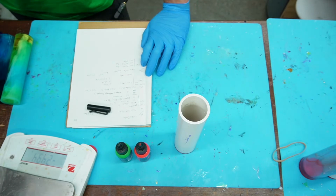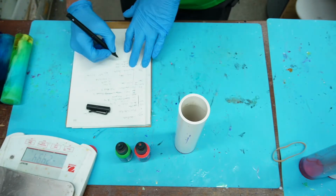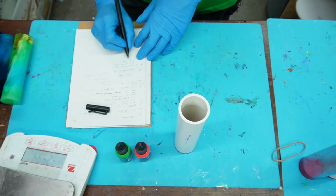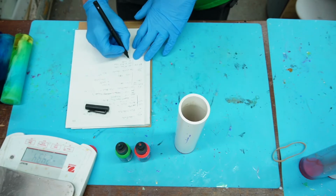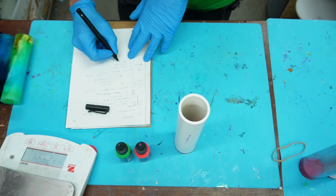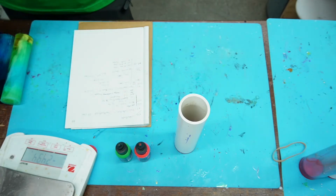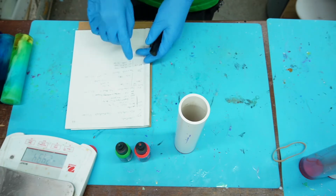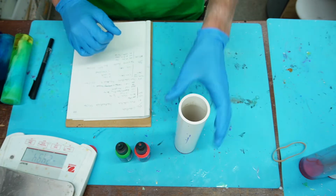All right, so we're looking at like a 1%. It's tough because the way that I estimate my dyes, I'm actually factoring a percentage against half the dye, and I don't want to explain that. So 30 grams of resin, and then we're going to add 0.3 grams of dye to that. Depending on how you look at it, if you're just doing a percentage factored against the total amount of resin, the A and B, then we're looking at 1%, not 10%. 5% is the most that you want to go.